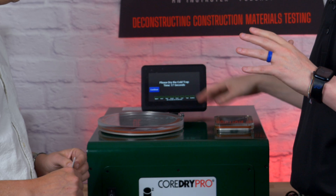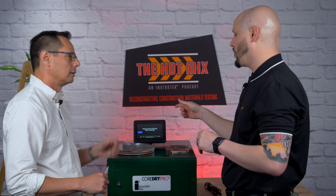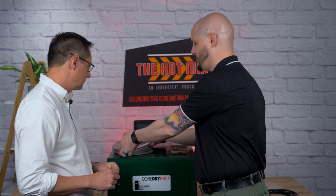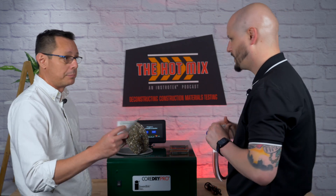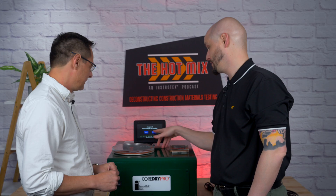The initial thing you'll see is it's basically cooling down and getting the cold trap ready, which is the pump saver. You can bypass this, but we recommend you let it go the entire 60 seconds. If you're turning it on for the first time in the day, let it go. The next screen gives you two options: menu and start. If you're just ready to dry a core, hit the start button and put your core right in there. You want to make sure airflow goes through the core — stand it up like a wheel, less surface area for water to get caught while drying.